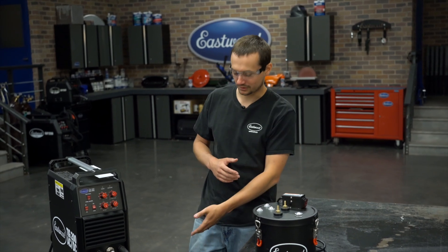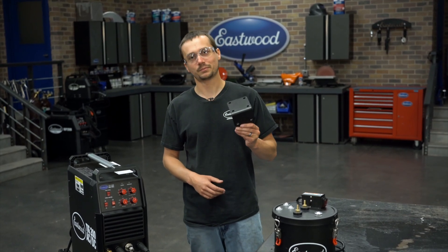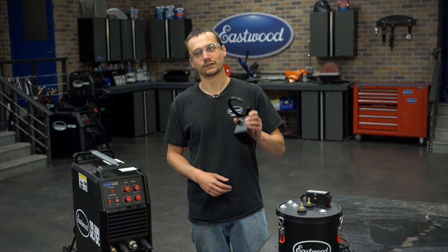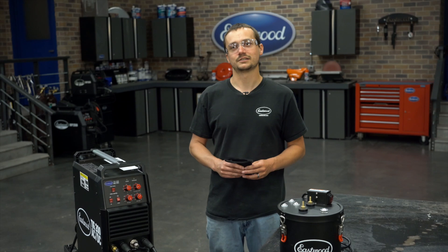The next part of setup is figuring out where you're going to put your TIG torch cooler reservoir. The easiest thing to do is use it as-is — put it on the bottom of your cart, so it's easy to get to, easy to change the coolant or drain, and it's just a nice compact setup. Additionally, we've got two brackets offered as accessories: a wall mount bracket that you can mount on a wall or on the side of your cart, or a gas bottle bracket. We really like the gas bottle bracket because it puts it out of the way, you can still use the bottom of your cart, and it's still easy to change your coolant.